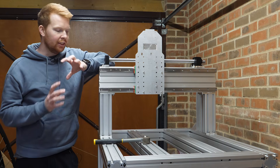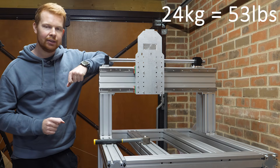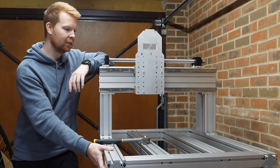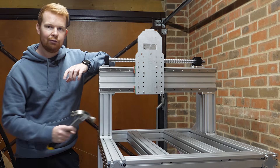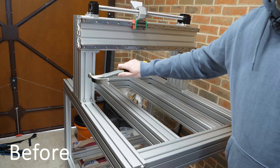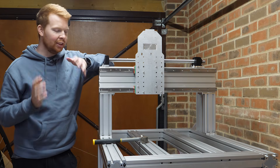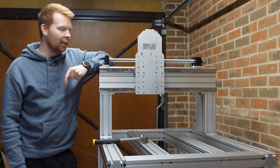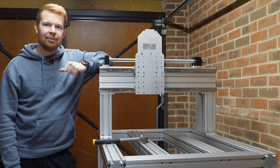After about two weeks of dismantling this machine and filling it with sand and epoxy resin, I've estimated the weight has increased by about 24 kilograms. It's very hard to actually weigh this machine, but from the internal volume of the extrusions and the density of the sand and resin I've estimated it to be roughly about 24 kilograms, which has adjusted the resonant frequency a bit. But the machine still rings a lot and it's very difficult to tell how this is going to affect the cutting quality in the end, as obviously I haven't finished the machine yet. Thank you very much for watching - if you're enjoying this CNC series then please subscribe, and I'll see you in part three.